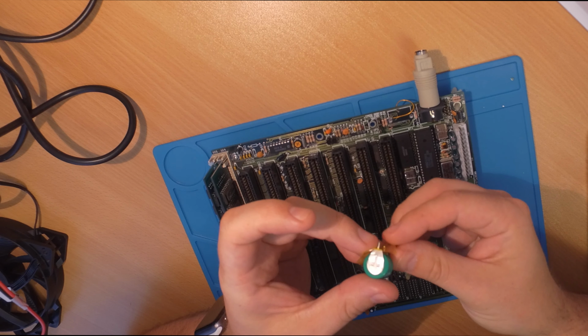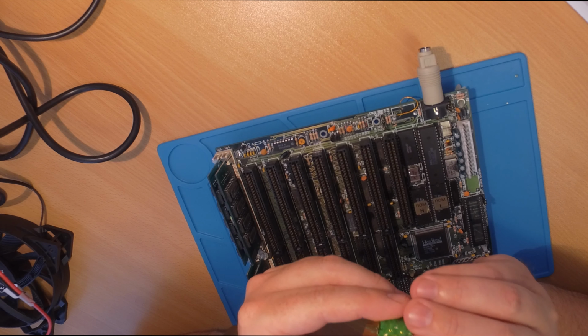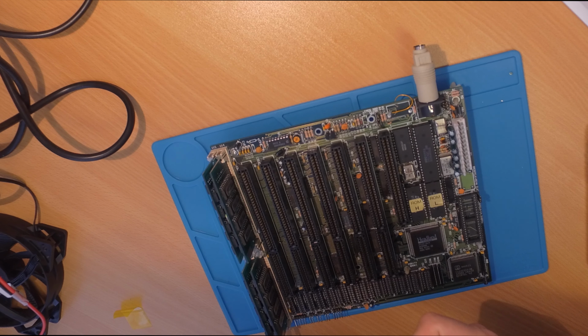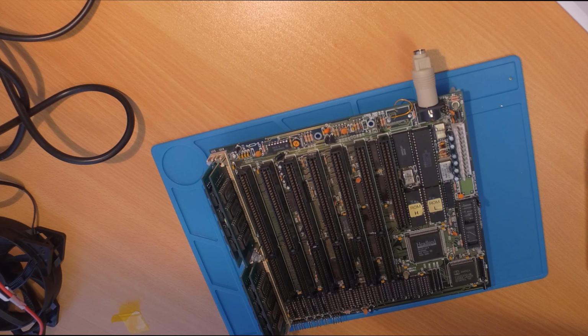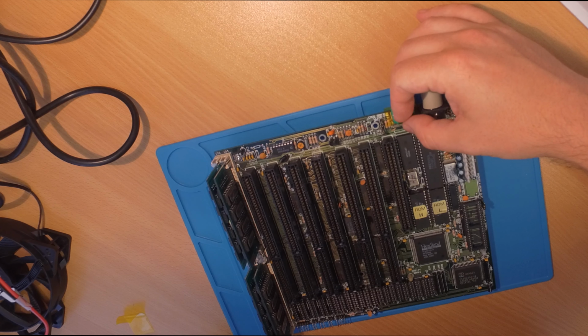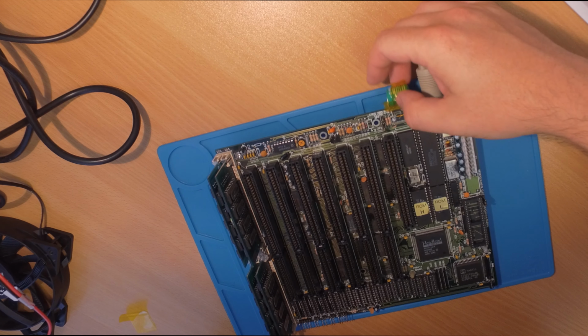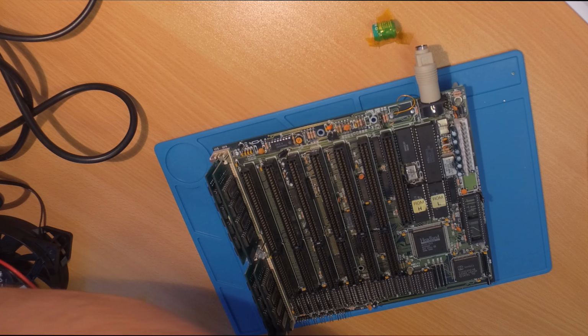You could also put a more generous amount of solder mask, that way that would be the first thing to get melted down if the battery was to leak again. I went with the Kapton tape because I thought, well, it doesn't look all that bad. And probably I could get away with just that. I don't know how long these systems are going to work anyway, or how long they are going to be relevant in the sense that people would like to collect them. So I've decided that, yep, another 10 years, and adding that kind of battery would be basically fine.